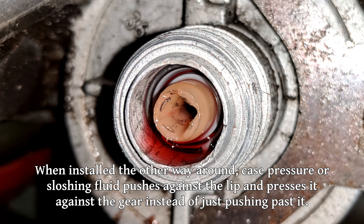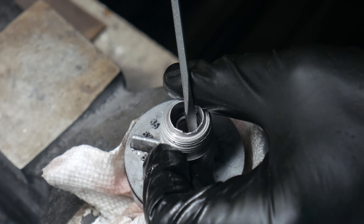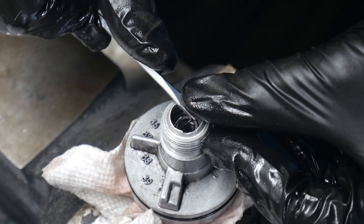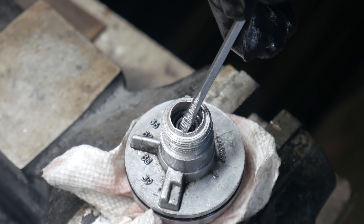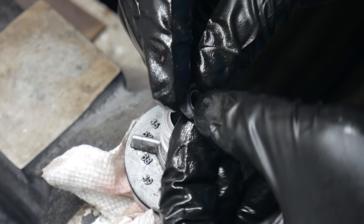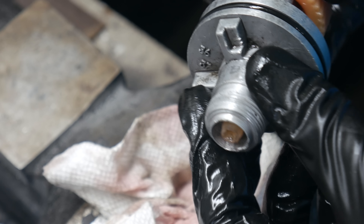The seal is only a couple of years old, but we have a replacement and I want to correct that orientation mistake. It's retained in the housing by a spring clip, which we remove using a small flathead screwdriver. It's not locked into a groove — it just presses outward against the housing to keep the seal from walking out. We lift one end of the clip out carefully, without bending it too much. With the clip removed, we lift out the seal — it's a soft, fully silicone seal — using the flathead screwdriver, being careful not to scratch the housing. We also inspected the housing and it doesn't appear worn.